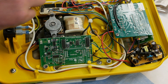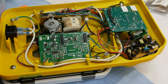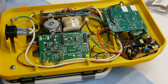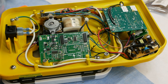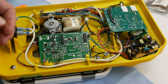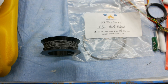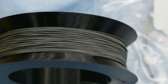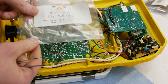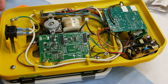For this prototype I just used plain old magnet wire, but this is an interesting construction detail — you can't really get away with this for a real product. Even high-temperature magnet wire is only good for maybe 100 or 200 degrees C, but the hot plate itself can easily get up to 500 or 600 degrees C. We had a great solution: there's another kind of wire that's ceramic-coated — not coated with resin or polymer but with a ceramic — so it can easily go up to 500 or 600°C, and it's very thin so you can jam it under the heating elements and still get it close to the surface for a good signal from the tag.